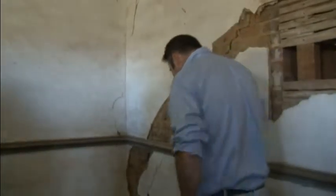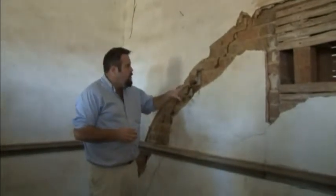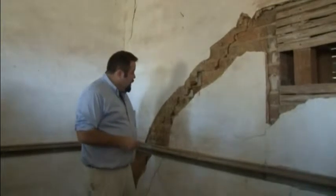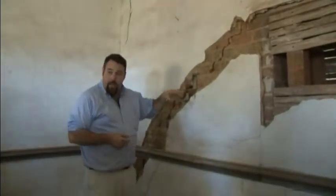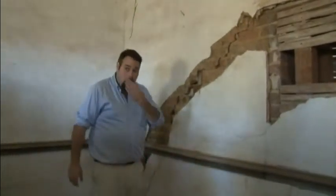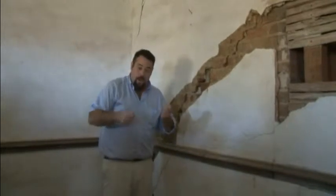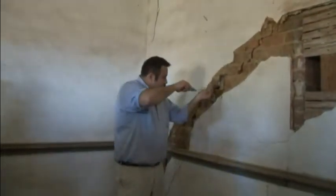But in a normal case, you'd have a smaller void. You dam that up, let it set up a bit, get nice and tough, and then you could just pour and work the grout in that way. When you say dam it up — are you saying to build it up so you have less liquid coming out, squirting out? Basically, just have enough void that you can fit whatever attachment — the syringe — and then just work that in and pump.